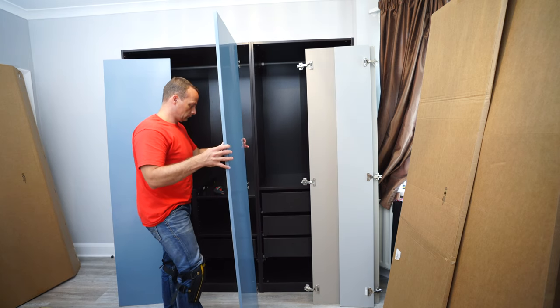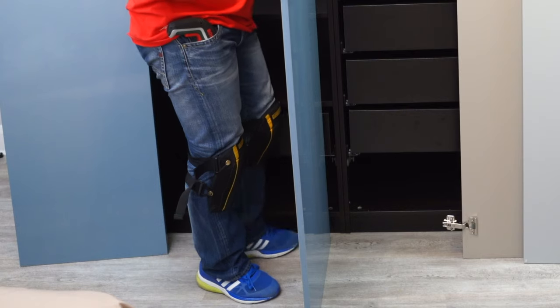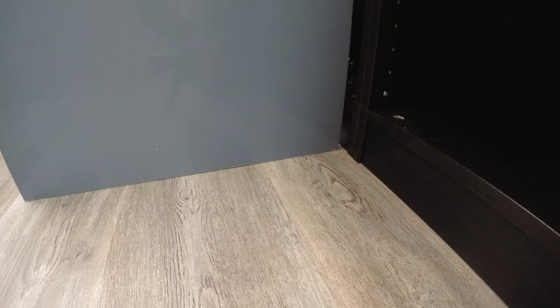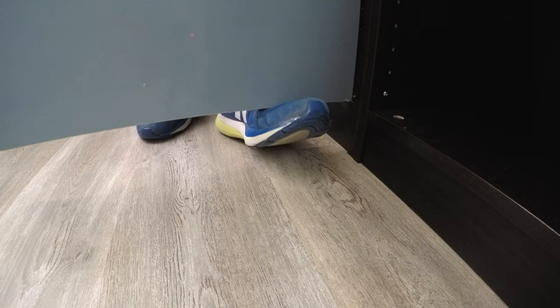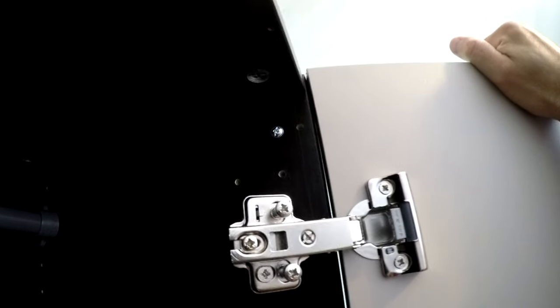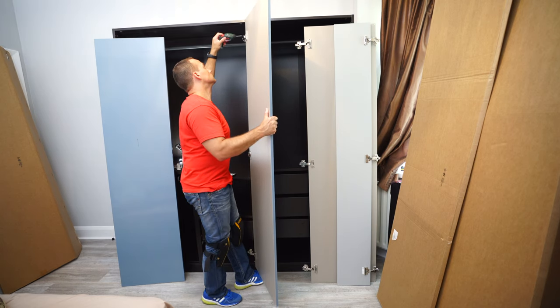Now I'm going to show you how to put the doors up. I have a small screwdriver — the link is in the description. Working alone, I put one foot under the door, hold the door from one side and on the top, and adjust with my foot up or down depending on where the holes are. If you have someone with you it's much easier. With the screwdriver I can secure the top hinge. After you secure the first screws it gets easier — you can let go from the side. Just make sure the screw is completely in so the door doesn't flip.